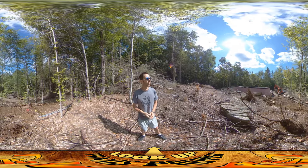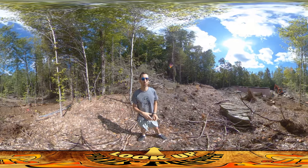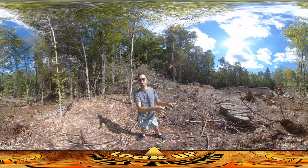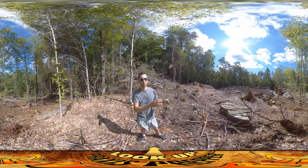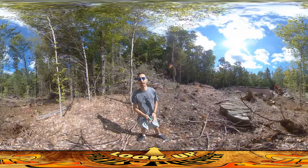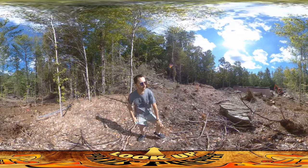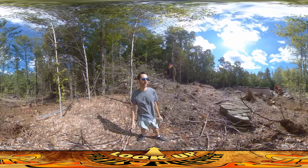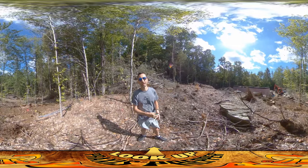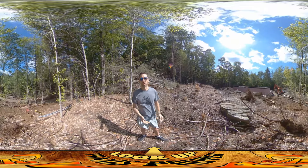I got here a little bit earlier before them this morning and I took a stick and poked through all the pass-throughs out through the foam, so we'd know the heights of them — where they are on the outside of the foundation in terms of the water line — so we wouldn't be filling in that area where the water line has to come in anyway. I also drew a fill line all along the back wall so they'd have a sense of where it would be good to fill up to, because I still have to do another course of foam over the back wall. I'm hoping they can put in the perimeter drain, fill it in, and then I can stand right on top of it and put up the last layer of foam.